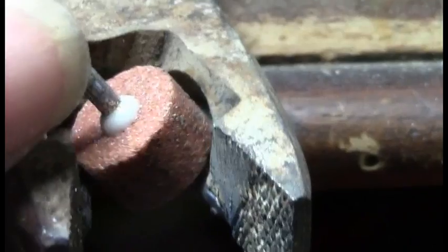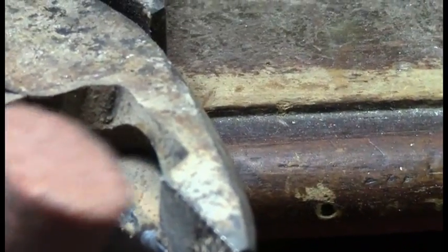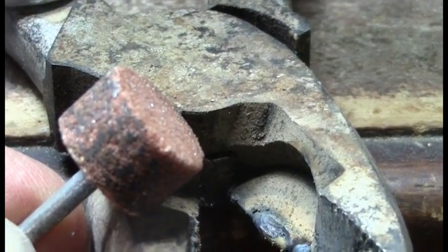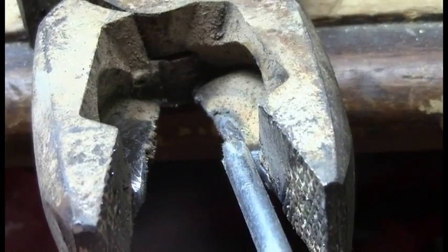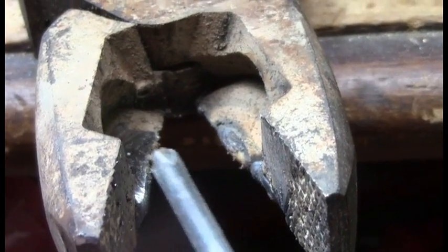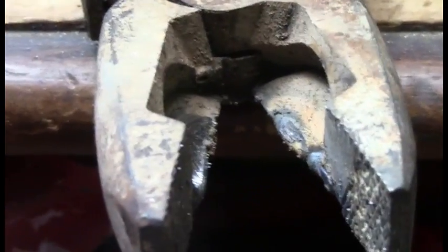The outside is not angled, so this is a flat grinding wheel and that's what you want. But you have to be careful because you need both sides to be even — you don't want to grind one side lower than the other, because then you won't have cutting action. It'll be more of a bending action; in other words, it won't cut straight across. So you need your cutters to be pretty much right straight across.